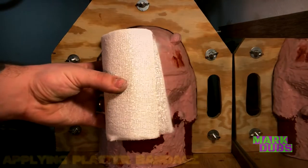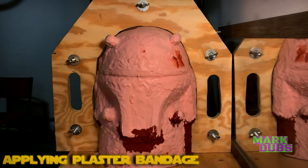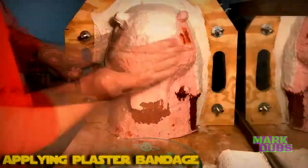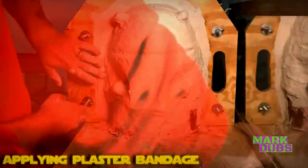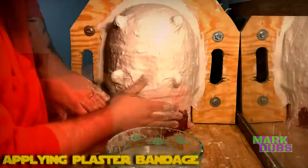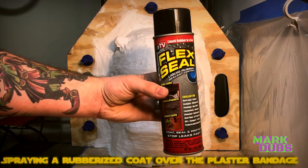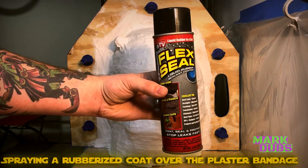With the mother mold and silicone jacket inserted, the casting resin poured in will end up being anywhere from 25 to 30 pounds, so having handles on the sides makes sense. Applying plaster bandage is quite simple — it activates with warm water and you have around 7 to 10 minutes before it completely dries.